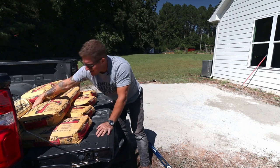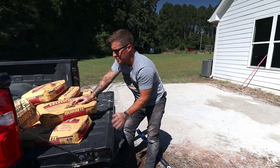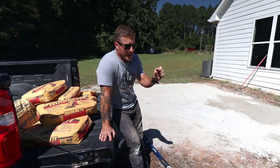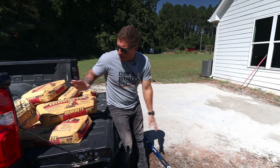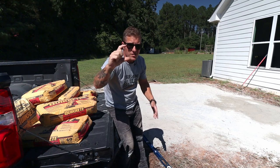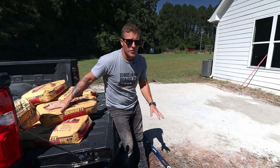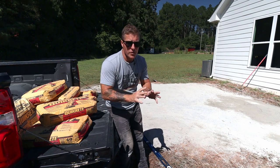One thing I'm going to add is this sand concrete topping mix. This is actually made for flagstone patios and pavers — it's pretty much sand that has concrete mixed in with it. I'm going to put it out dry, about a quarter to a half inch layer on top of the crushed granite. This is going to help me with setting my flagstones level because the flagstones are anywhere from one inch to about an inch and three quarters thick, so there's a lot of variance. I'll skim it straight and then wet it to lock everything in.